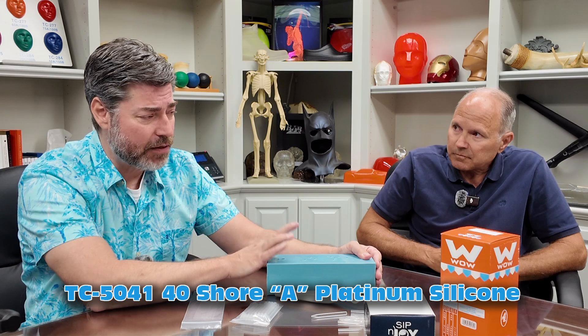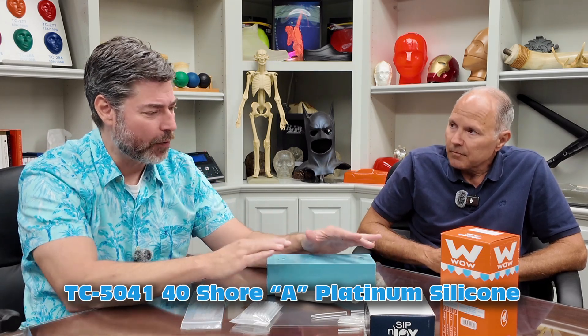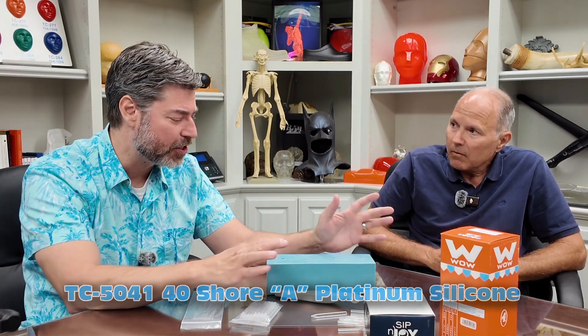So the 50-41, following that protocol, is pretty safe. But always — and I'll link on the end screen — I'm going to link to the cure inhibition video because when in doubt, always run a test. There are radically different platinum systems out there; some are more susceptible to inhibition than others. Don't assume that all the chemistry is the same. Somebody's SLA post-processing might not be as good as somebody else's, and so it could be an issue.